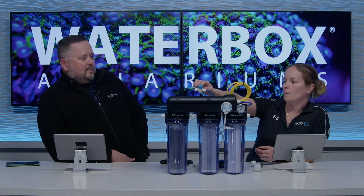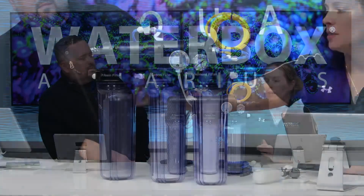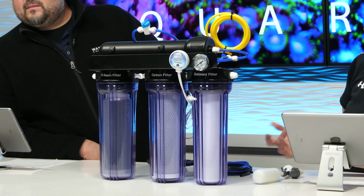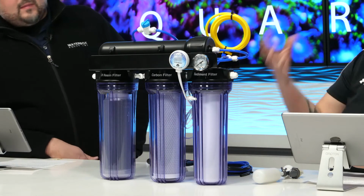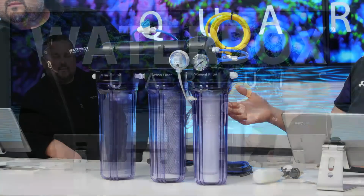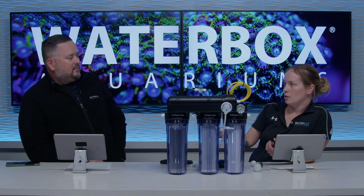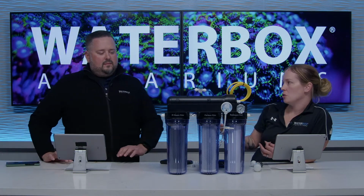And from there, your last and final stage is the DI, the deionization cartridge. This is resin that's in there. It is color changing, so it will change colors as it becomes exhausted. This is now going to take the TDS that comes from the membrane, say 2, or it will increase as the unit gets a little older, and take it down to 0. That's what completely purifies it from just RO water down to RODI, which is an uncharged water molecule, nothing to it.